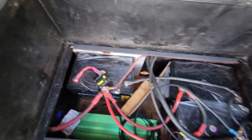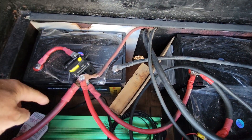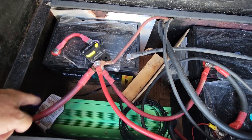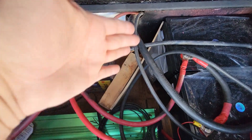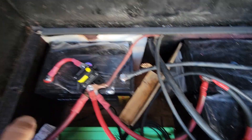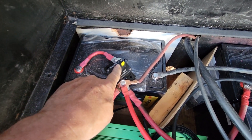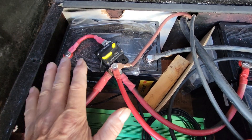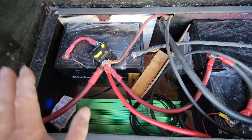You're probably wondering what these boards are for. The air intake for cooling the inverter comes in from the front and the hot air exits out the back. I've placed a separation board between the cold air intake and the hot air exhaust. I also added weather stripping to raise the step about a quarter inch to clear everything. If I had more space I could display everything more neatly, but you've got to work with what you have.